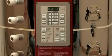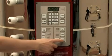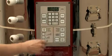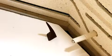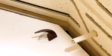To use cone correlation to calculate your final temperature during a ramp hold program, press cone table instead of entering a temperature for your final heating segment. Input the cone value you would like to correlate and press enter. Now instead of firing to a specific temperature, the controller will make adjustments to the final temperature to ensure the right cone correlation, just as in cone fire mode.